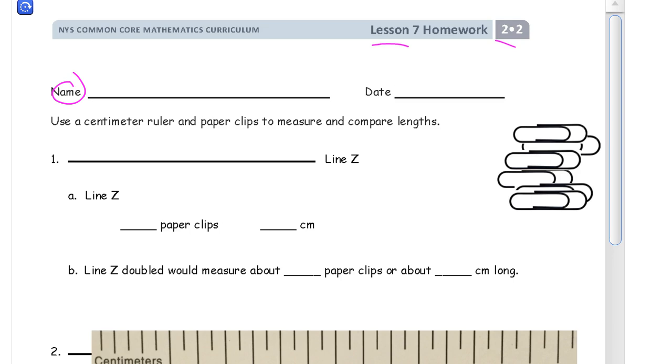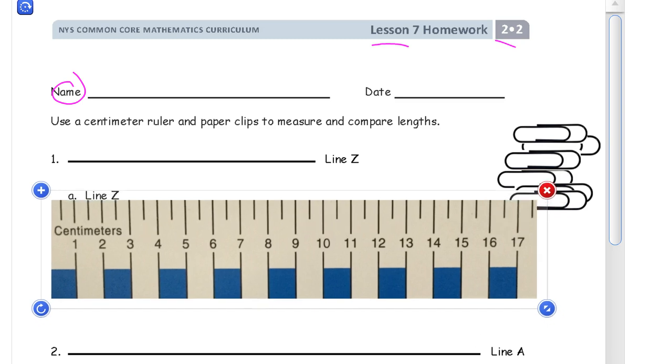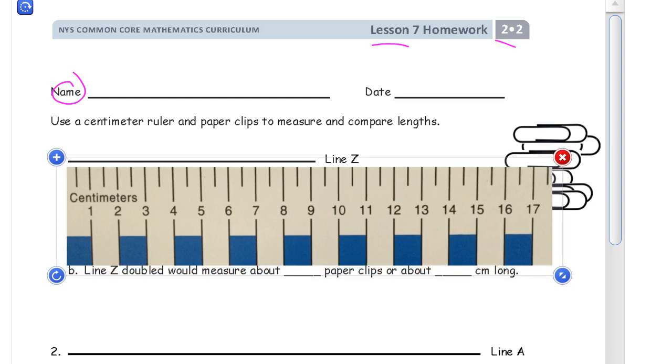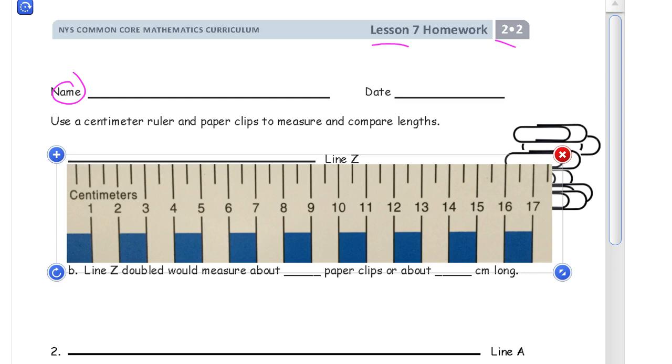Here's line 1. First I'm going to measure it with a ruler and then measure it with a paper clip. This ruler doesn't have a zero line, so I have to use the end of the ruler and line that up with the end point of the line. I can see it's almost exactly 9 centimeters, so I'm going to call it 9. Your measurement might be a little shorter if the copy machine scaled it down. This ruler has halfway marks between the centimeters — don't write 8.5 centimeters. We use only the closest whole centimeter. No fractions of centimeters please.